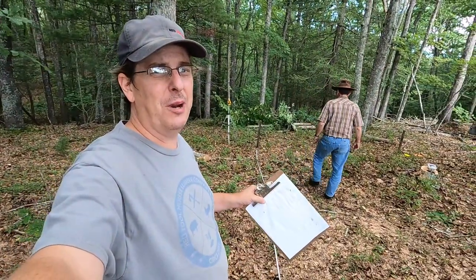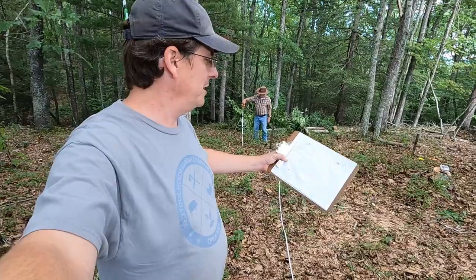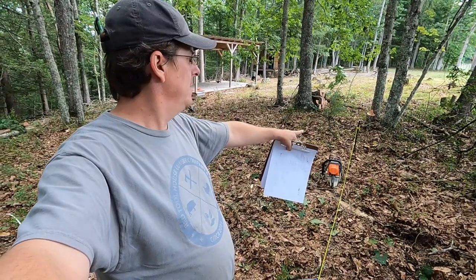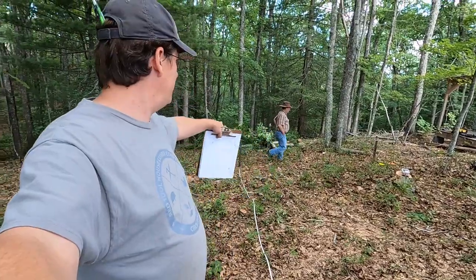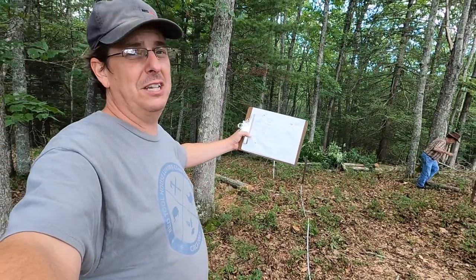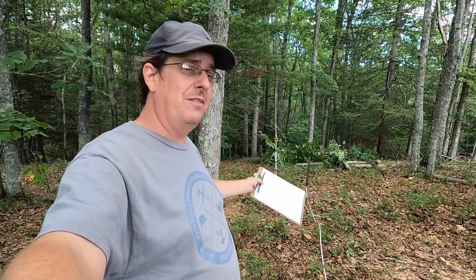This is why you do the layout the way you do. Even on ground I would consider West Virginia flat, there is a relief. On the front corner, if I want a 22-inch crawl space at the highest corner — closest to the ground — then the other three corners are slaves to that height. This back corner, the lowest where Dad was, means the bottom of the floor is at 56 and three-quarter inches — almost five feet off the ground. So it's going to be a tall crawl space in the back, which is fine — we can utilize that.